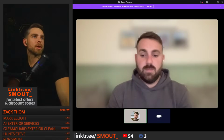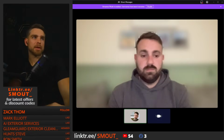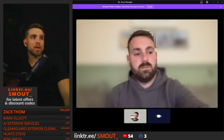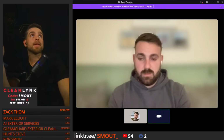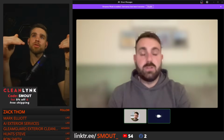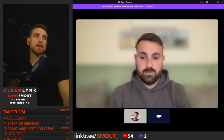Steve says, I can only comment on the ones that I've experienced, maybe I'm not watering it enough. To be honest, I totally understand what you're saying, and again, my experience is different from yours. But with regards to watering it enough, I think initially you can't really water it enough, and the fact that you're installing this sand and then flooding the surface with water, that sand's going to drop. If it's going to drop, it will drop at that point, won't it? When you've watered it, surely. It should, yeah. So it's going to fill the joints regardless. So I don't know if the whacker plate is entirely necessary, but I can see how it could help.